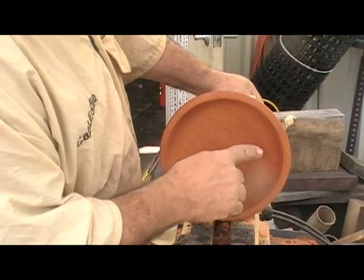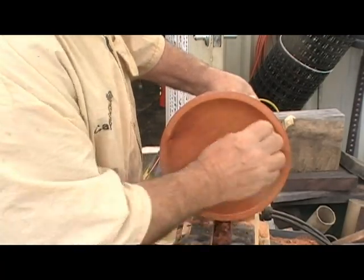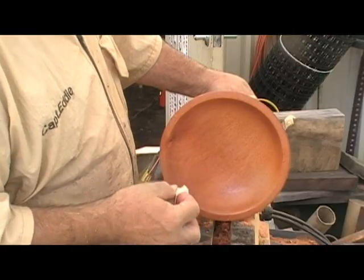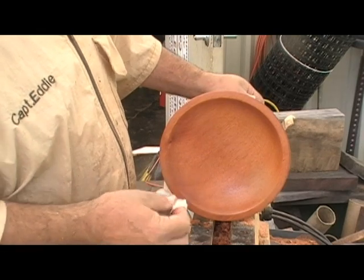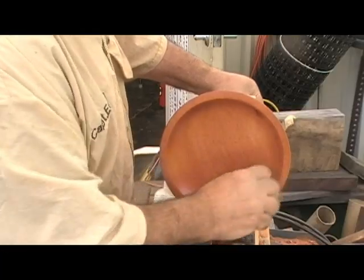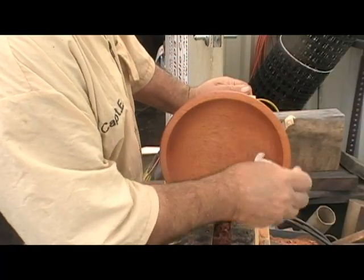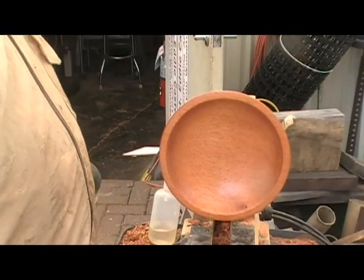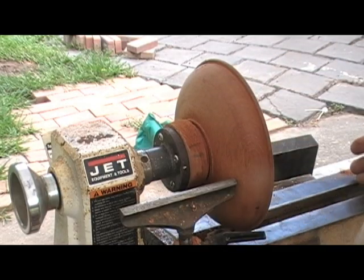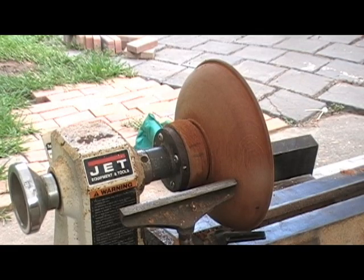If you do have a tear or a mark that shows through the sealant, it will never get any better until you remove it. So if I had a tear in here, I'd crank it back up, take the tool and work it out, then sand it and work it on through. Why put this much effort into a bowl in the last five minutes? With five more minutes of work, you can fix a really bad mistake or a tear you didn't have control over. We have a little finish on the face — I see absolutely no tool marks on it. As a beginner, I'd be quite pleased with this.